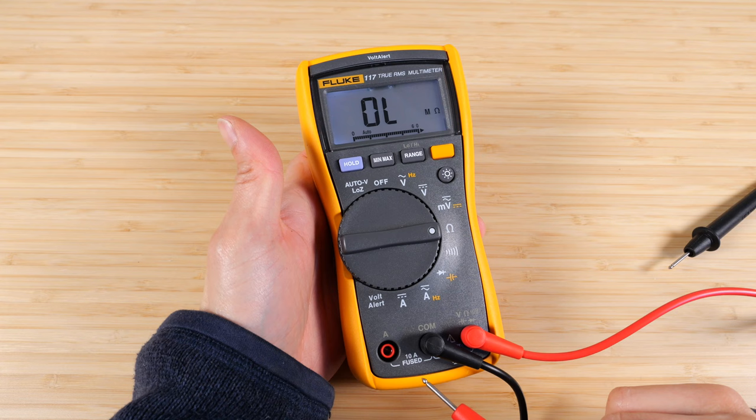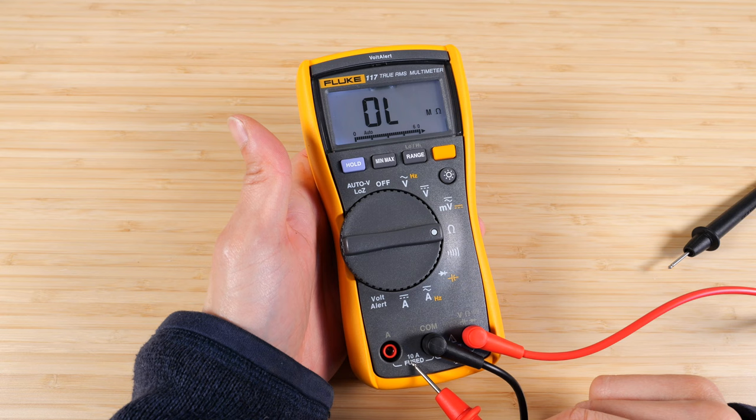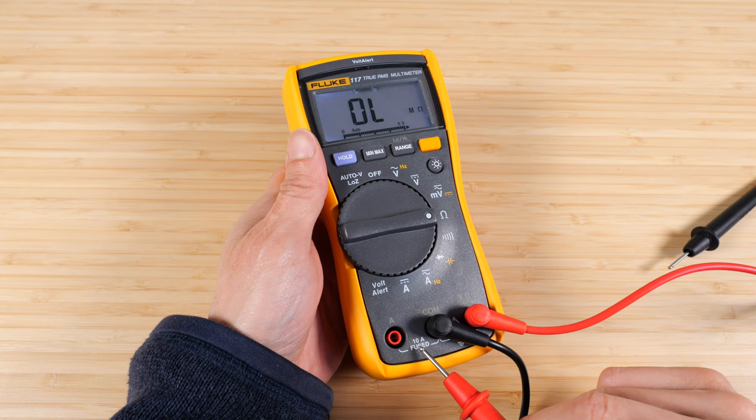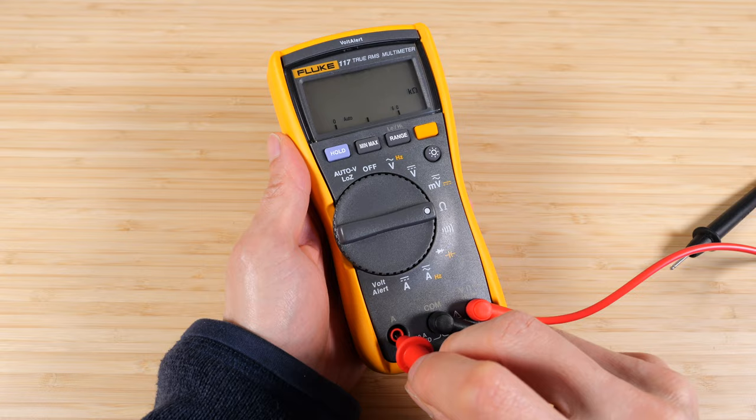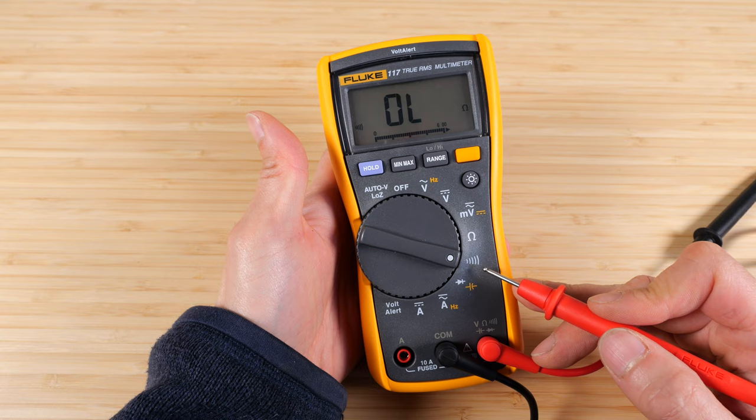There is a fuse inside this multimeter. If you ever go over 10 amps, it will break. These fuses are quite expensive — around $5 or $6 each — so have an idea that it's not over 10 amps. To check if the fuse is broken, change it to the resistance setting and bring your red lead to touch it over here. If the fuse is not broken, it will show you a low resistance reading like 0.2. Alternatively, you can use the continuity checker and touch it here and it'll beep.